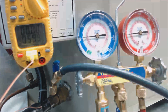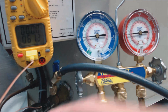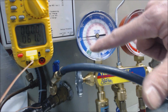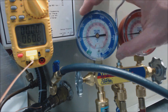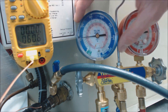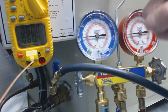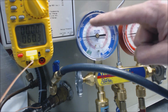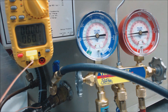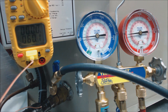It's the actual temperature on the vapor line within a few inches of the service port, minus the saturated green temperature on your gauge. There's a pressure-temperature scale built right into your gauge, so you can see where it brings it in. If it was 407A and I was checking the superheat for 407A, I would go to the pink or rose-colored ring. But that's it — that's how you check to see if your refrigerant charge is correct.